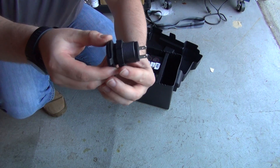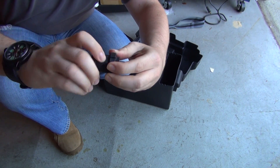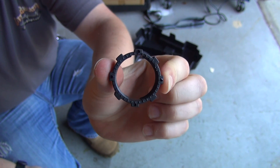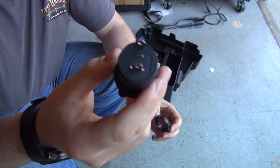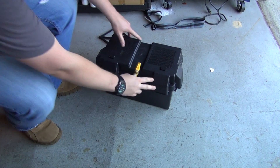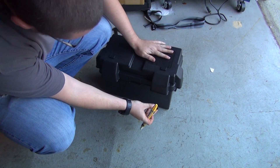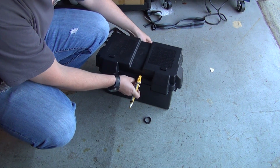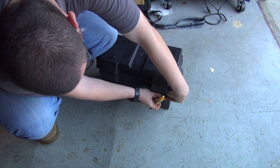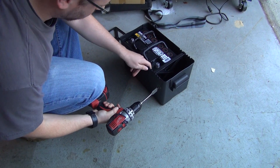With this one it's two separate pieces — this slides or screws into the backing plate, and the backing plate is how it's held on. So basically what we need to do is drill the hole about that big. Get a drill bit or step drill bit appropriate to the size of the hole you need. On the back of here it's marked already for you — plus and minus, plus being the red wire, negative or minus being the black wire. I want to be under one of these hoods just for safety, so if there is any rain, water stays away from this connection. I'll trace the circle — now when drilling, be careful you don't drill into the battery.